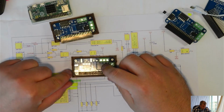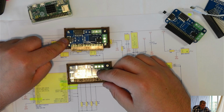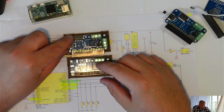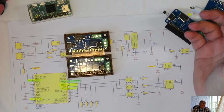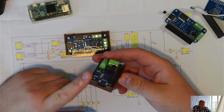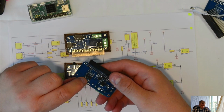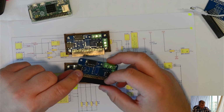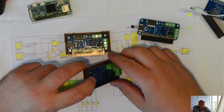This particular board, as you can see, I don't have the connectors. These are very expensive, and only these two connectors cost me over £6. I will be able to make those boards without those connectors. If you really wanted to use those ones, I will keep the optocouplers and the resistors for this input and this one here, but you will have to solder the connectors.